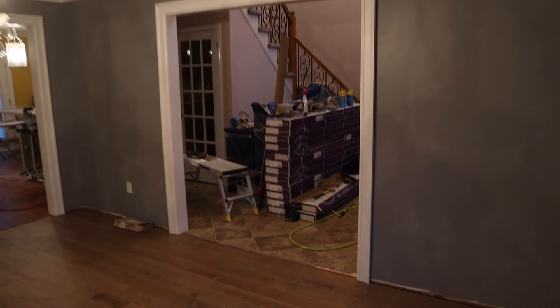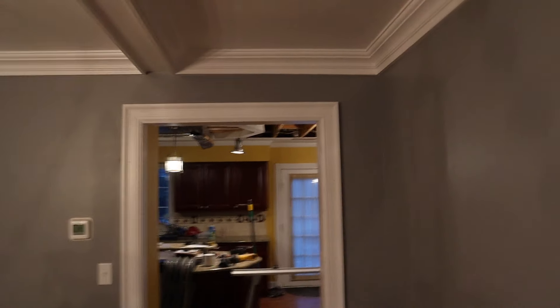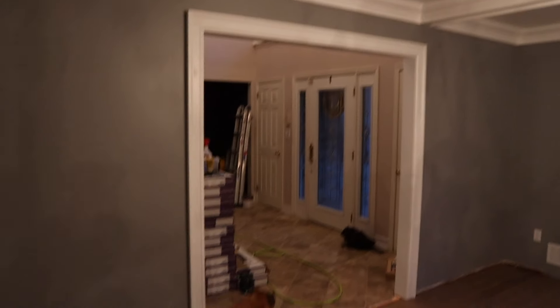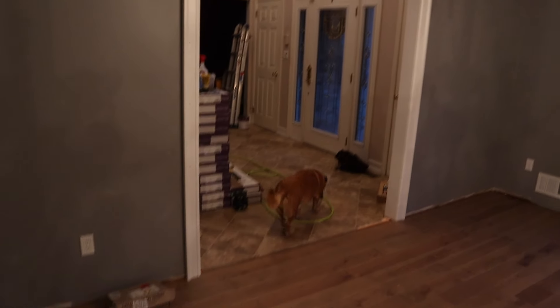Let's get a really quick look here. This is the casing — it's nice and tight to the floor, it's a really nice profile. There's your miters, nice reveal — quarter inch all the way. You could do a 3-sixteenths reveal if you want also; it doesn't always have to be quarter inch. You can see how that really complements the coffered ceiling — it just fits perfectly.